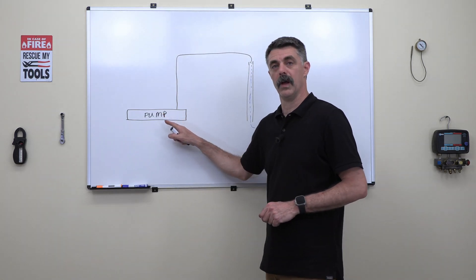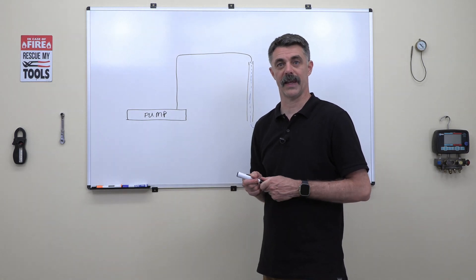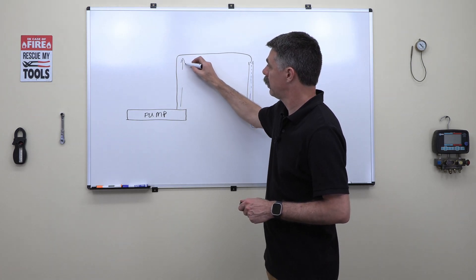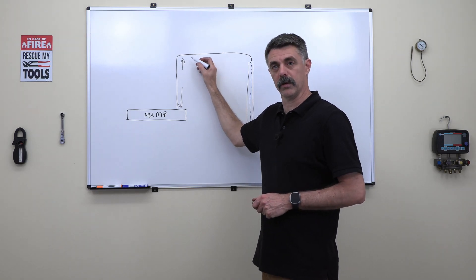Let's talk a little bit about pumping. When choosing a pump, you want to know how many feet of head it can push — or how high it can push — and whether it can push as high as you need. That is the vertical measurement between the top of the pump and the highest point you're going to pump to.